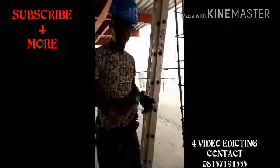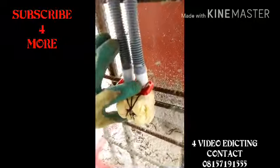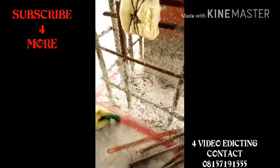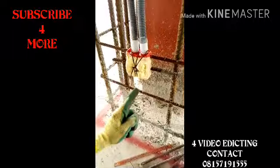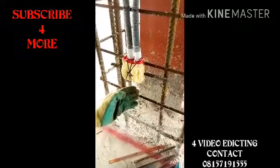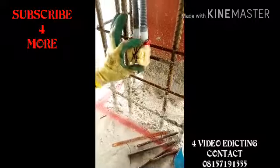As you can see, as my buddy had just explained to you earlier — if you look down keenly, this is the 3x3 PVC box. For you to get to this level, you measure from the slab to this level: that's 42 cm. To get the center, you measure from the beginning of the wall to the center: that's 24 cm. Then you have the middle of your box. This is the 3x3 electrical box.